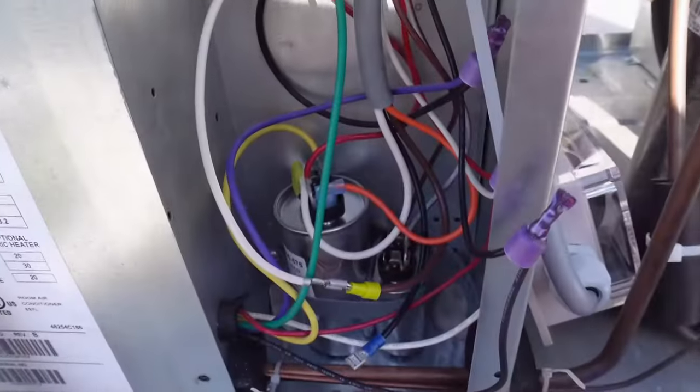Test number two with the Honda generator — kicking that up now. Going to cool, turning this on. After two starts it's already down to 14.4 amps — a lot better. With a total of five starts it's about 14.5 to 15.5 amps for our peak. For fun we'll see if the EcoFlow can do it — I doubt it, but why not.